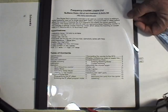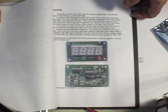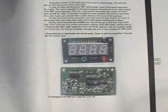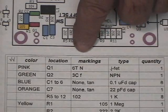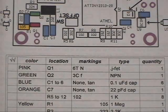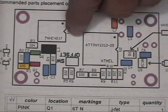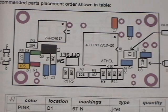You download the manual from the web page. Here's the finished look of what we're going to attempt to do. It says to install them in the order shown. The very first thing is Q1, which is a JFET, and its color is pink. We're going to look on the board to figure out where it goes — I can see Q1 down here — and we'll see if we can get it soldered in place.